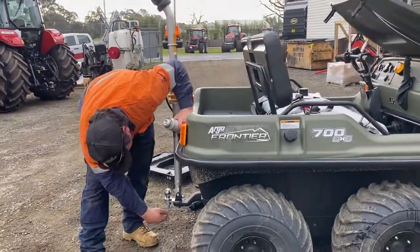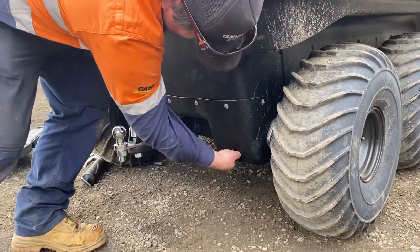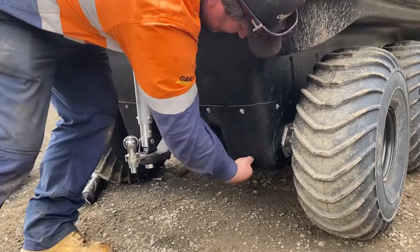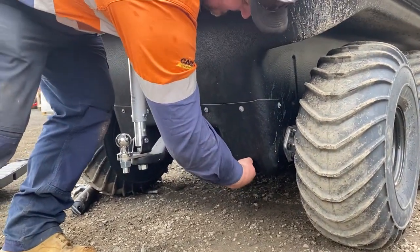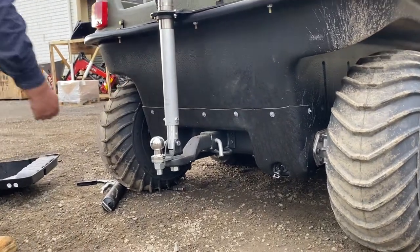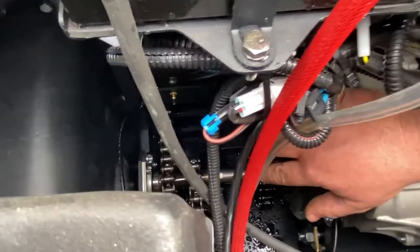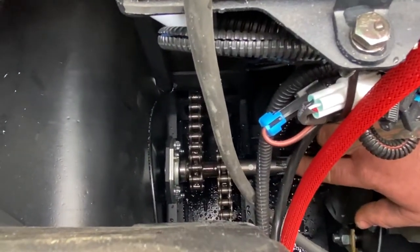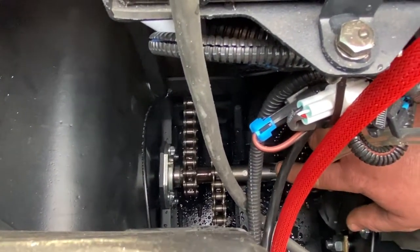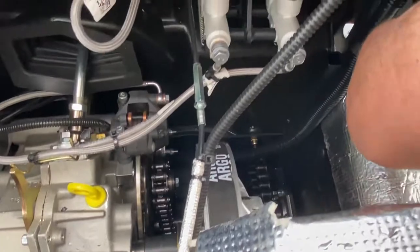We also make sure we're checking that there's no water in the back plugs. There are also grease nipples that need greasing at the front once a week — where both front chains meet on the same axle on the inside, and one on the left-hand side behind the muffler.